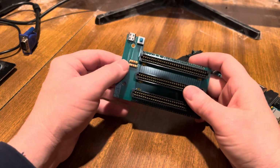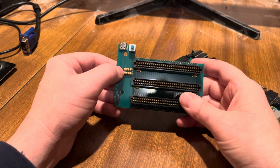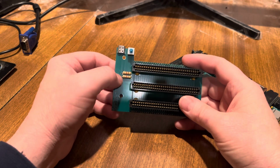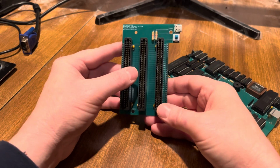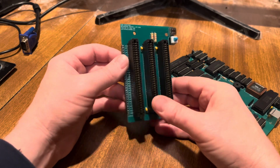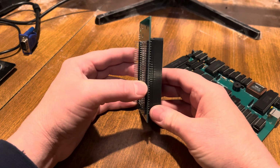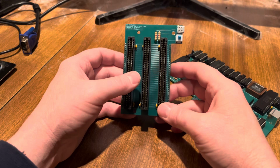I added the resistors from the last board. They indicate to the USB-C to provide 5-volt power. Now, with that being said, this is only 5-volt. There is no 12-volt or minus 12-volt on this board. There's a pin header there, and this is for plugging into a breadboard, which I'll show here in a minute.